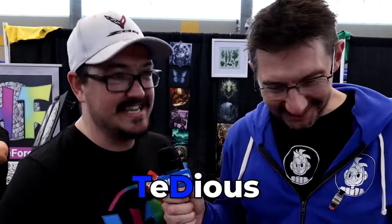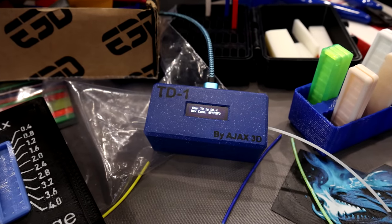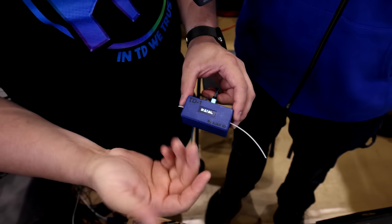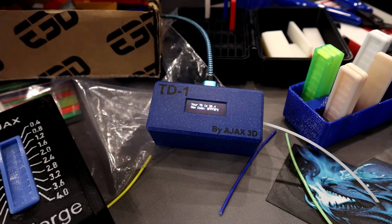Basically, we had all these ways of testing TD that were very intricate and very tedious to print. We wanted to be able to test directly off the filament, so I made this box from scratch using open-source Adafruit sensors and RGB NeoPixel LEDs like in the Voron. I threw some of those in to light up the filament from one side and check the TD from the other side.